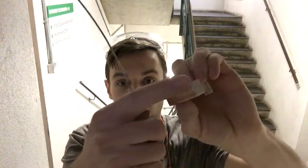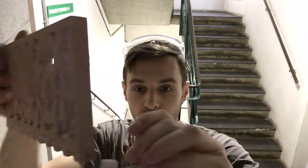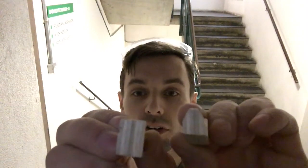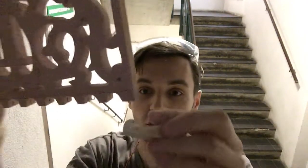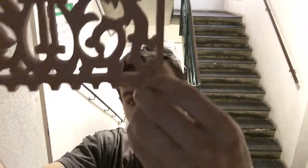The original keys — which Cheryl made while I was making the mainframe box — have a little button on the end to actually press. As you can see, there's a square part at the back where the armature wire goes through to give the pivot point. Once these went in the holes, they didn't fit far enough up for the holes to align with the holes in the faceplate. So what I've had to do is alter them — round the edges off and also taper them down on the side. Here's the original one, and here's the one I've altered. With that done, it will actually line up with the saw line I've put in so the wire can go through and the keys can be attached.